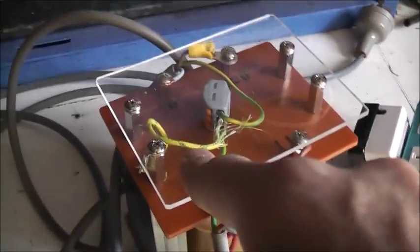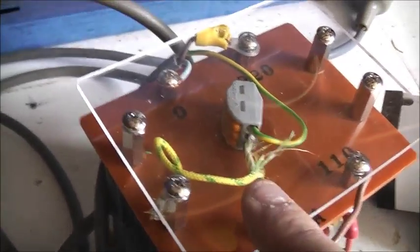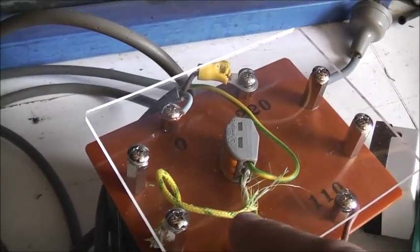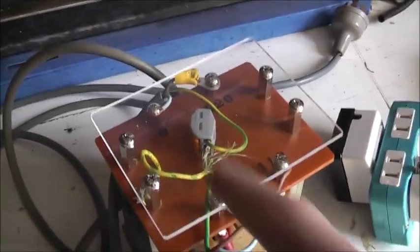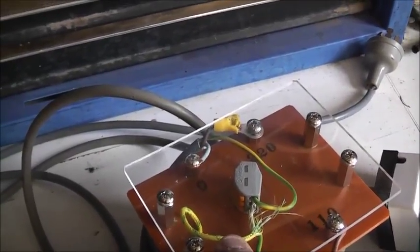I got my earth, got the Wago on there, the 3-way Wago, perfect. And it's a recycled wire from a Chinese rice cooker. High temperature wiring that, so I would encourage you to keep this sort of wiring from little cheap Chinese heater appliances like that, because this high temperature rated wiring is good for the ZVS primary windings. They can get quite hot and the insulation stays relatively intact. So a good cheap source of high temperature resistant sheathed wiring is in cheap Chinese cooking appliances.